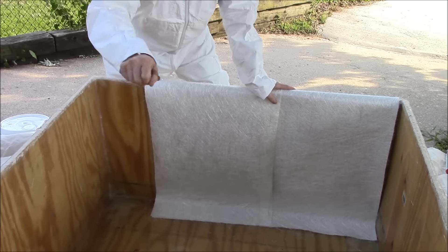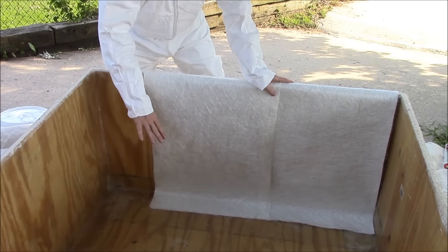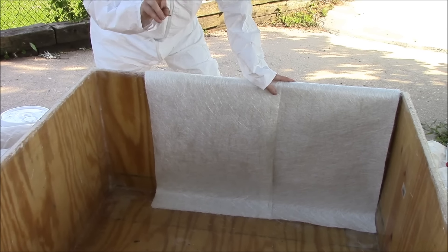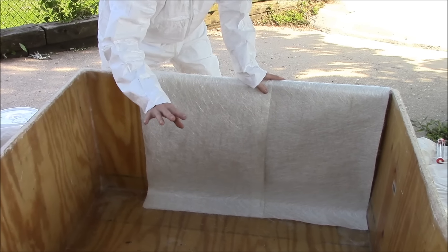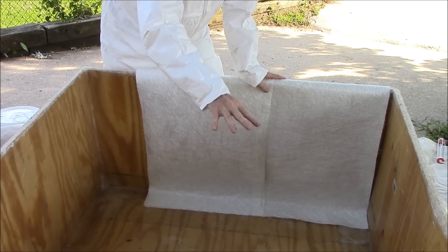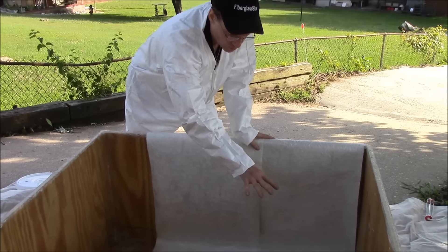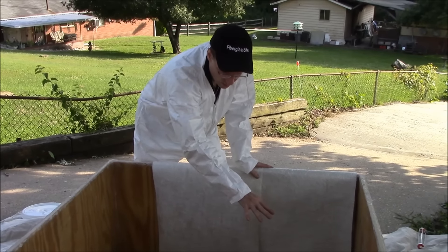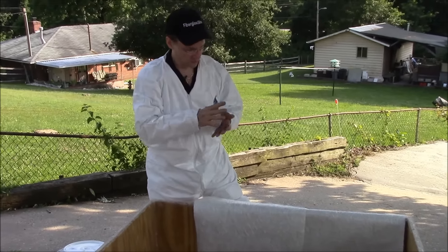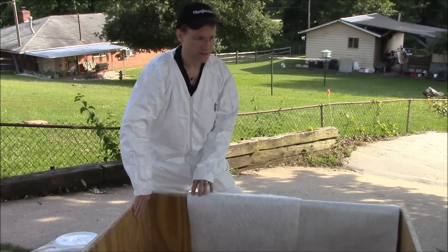The floor is the easiest part because you can just lay the resin down like a carpet over top of the overlap. You lay the first layer of 1.5 ounce chop strand mat down and saturate it with polyester resin. While it's still wet if you can, lay down the second layer of 1.5 ounce chop strand mat and saturate that with polyester resin, then move to your next section. Once you have the entire pool done, you've got at least two or three days while it's going to remain tacky. This is something we did yesterday and it's still good and tacky.